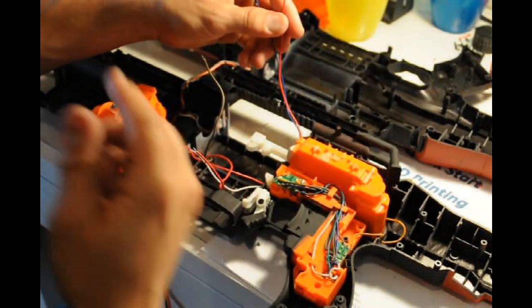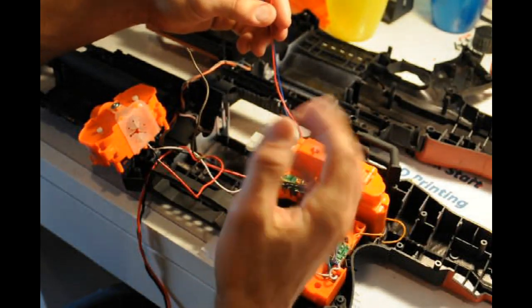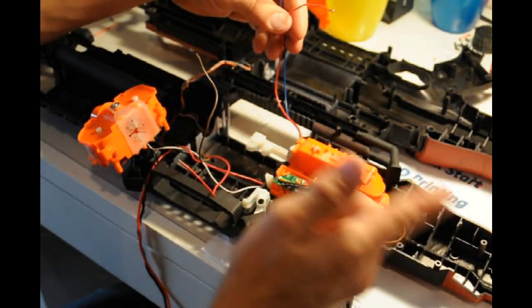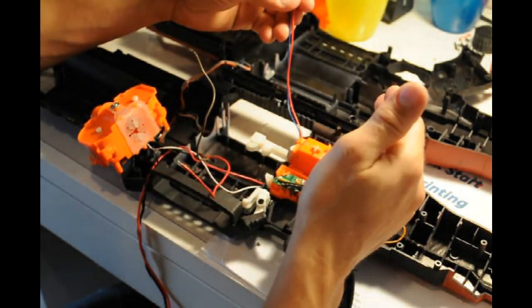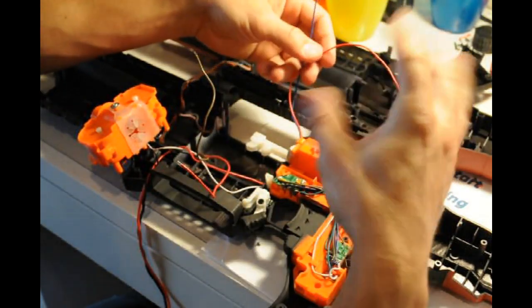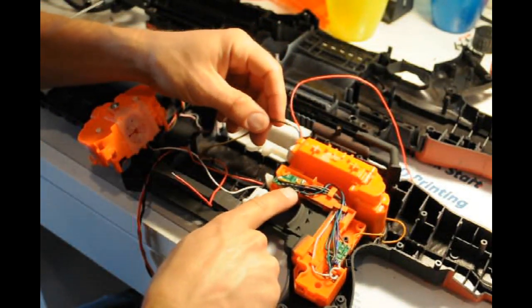What I've got to do now in order to get this to work correctly is this is basically a breaker in the circuit. When the little button is completely retracted, the circuit's connected, feeds power, and it lights up. When it's pressed down, it turns it off. So every time this taps the button, it creates that blink. In order for me to get that, I put a dark wire and then a red wire, but these have both got to basically be positive. So in hindsight, I probably would have used another red or a pink wire, a lighter one. They both got to be positive, so that the positive feed to these lights is broken, creating the blink, and then this negative ground to the LEDs, I just tack on. If you follow the wires, you'll see that down here is the negative ground.